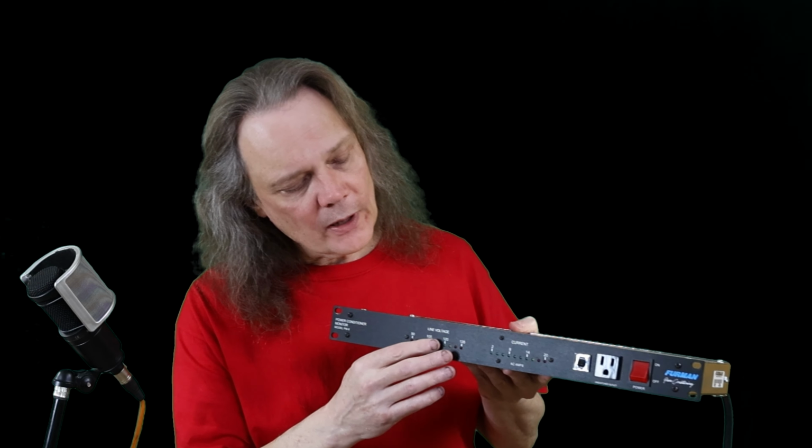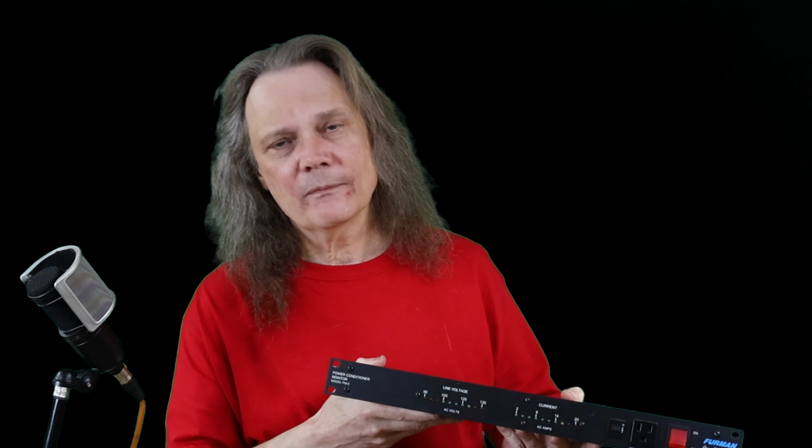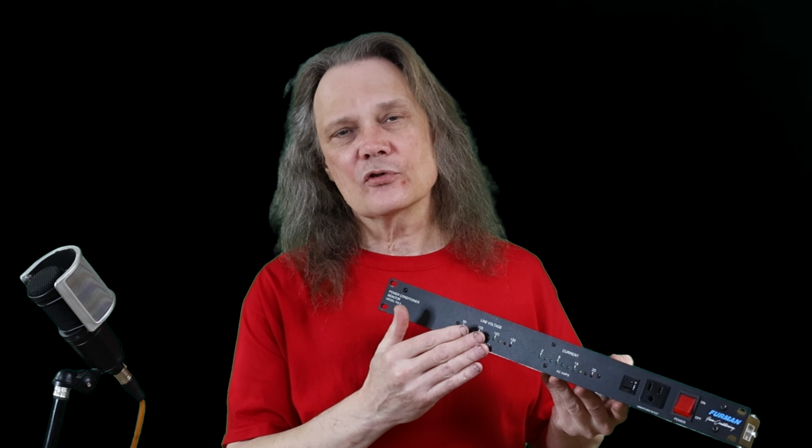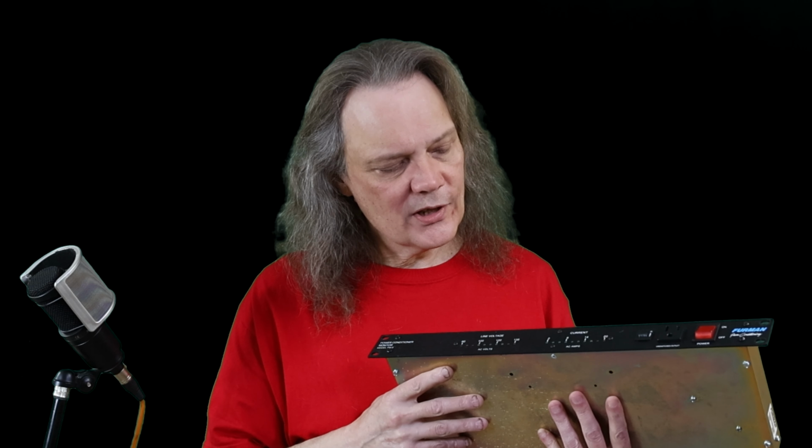This one also has a current meter on it, an amp meter. And that's only really useful in racks that have equipment that draw a whole lot of power. And this one came out of a rack that had a bunch of power amps in it. And those power amps could potentially draw more current than the circuit could deliver if things were really dimed out. And so if the show is rocking pretty hard and I glance at this meter and see that the amperage draw is approaching what the circuit limitation is, well, maybe that will inspire me to turn things down a little bit.